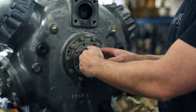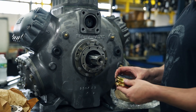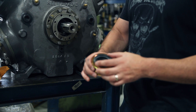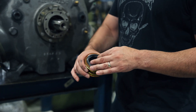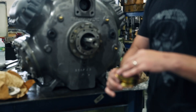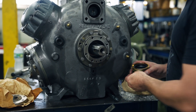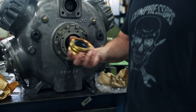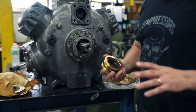You're going to want to put a fair amount of oil on there before you put this on. On these style seals, on most seals, there's going to be a carbon that's loose. Before you put this on, I recommend taking the seal off very carefully and keeping it to the side so you don't risk pushing it, damaging it, scratching it, or cracking it — since there's a carbon, it's very easy to crack.